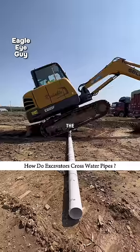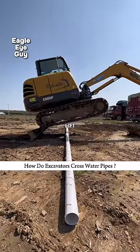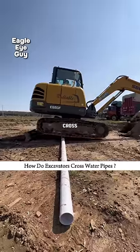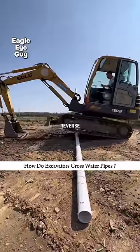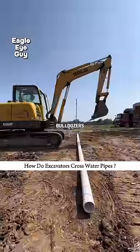The beginner chooses to raise the excavator tracks, move halfway, use the bulldozer to lift the remaining half, then lift the main arm and lower the front. This allows the excavator to cross halfway. They then lift the main arm again, turn around, and use the elbow for side support in reverse. While effective for small excavators, this method doesn't work for larger ones without bulldozers.